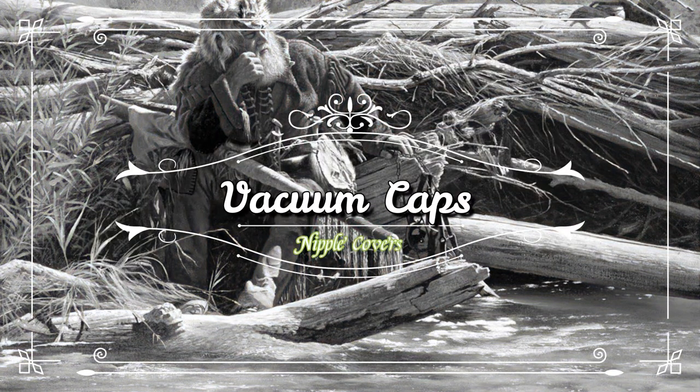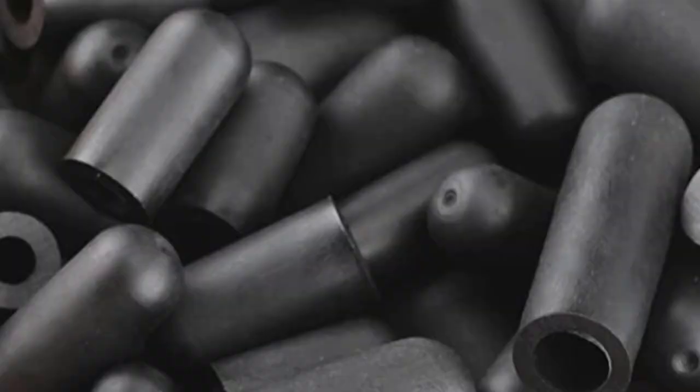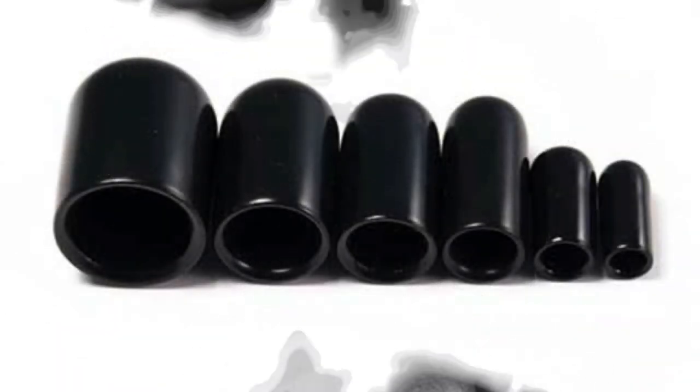Flexible vacuum caps can be easily cut to the length desired. They can be cut to cover just the cone upper or the entire base of the cone. One end of the vacuum cap is rounded, which works well with the rounded internal of the hammer, cushioning the blow when the hammer strikes the vacuum cap. I like a bit of air space between the cone and the inside of the vacuum cap for added protection.